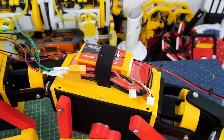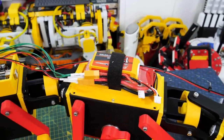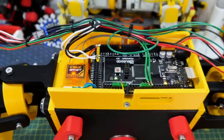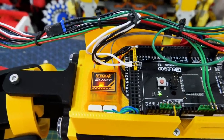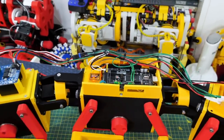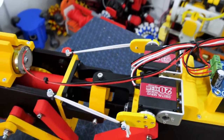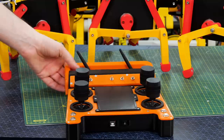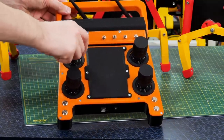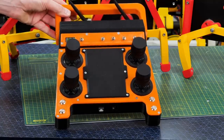I've wired that in and added another battery for the servos — a 2S LiPo because they won't run on a 3S. There's a DRX unit there which is the radio control receiver so we can radio control this and drive it around like an RC car. The motor driver is wired in and the servos are linked to basically two bits of bungee cord. I'm going to use the universal DSM remote that I made in a video a few weeks ago, which I'm now using for all my robots.